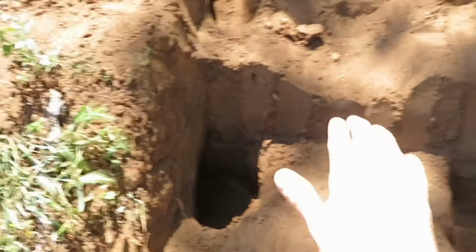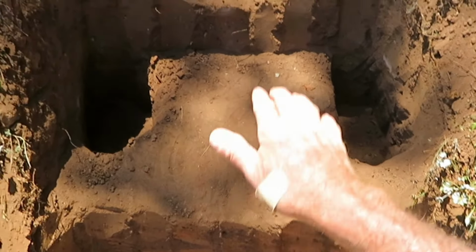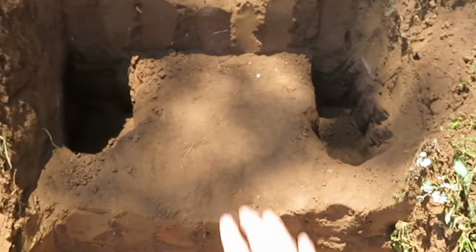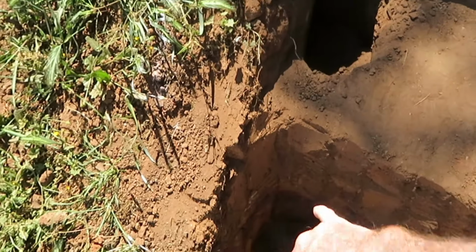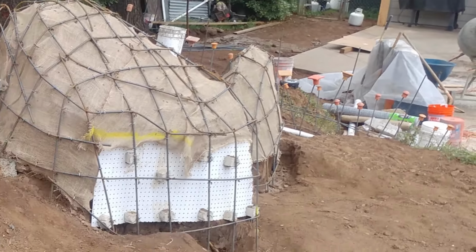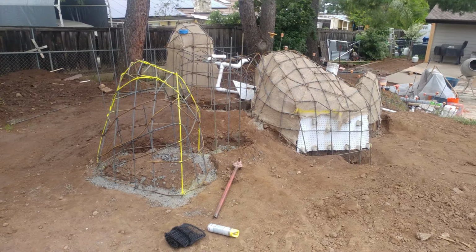So we have our terraces for the slide. That's what the engineering calls for a lot of times. Just flat places, so the slide itself can't slide down into the pool because it's actually on flat ground, basically. These little pockets right here, we're going to put rebar in, concrete them in, pre-pour them, probably 2 sticks each hole. Once those go off, then we have a complete perimeter that we can use for the slide steel, and it's going to come up on here.